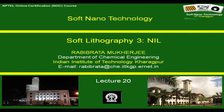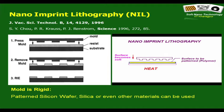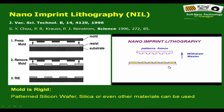Welcome back to our discussion on soft lithography. More specifically, we are discussing nanoimprint lithography. Quick recap of what we discussed in the previous class: this schematic should make sense to you now. This is a simple schematic of thermal NIL — you take advantage of the fact that you can soften a glassy polymer by heating it beyond its glass transition temperature. You have a mold with relief structures or topographic patterns, and you simply press it hard against the softened film to create a negative replica.